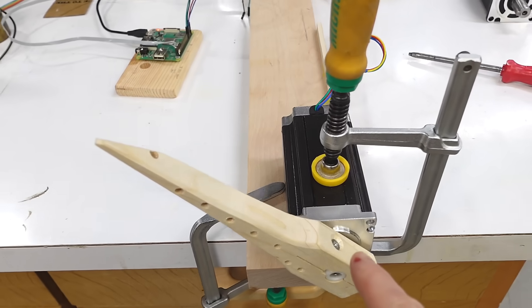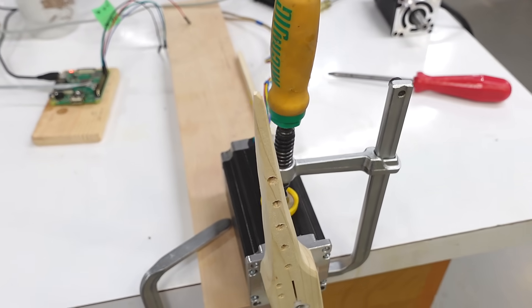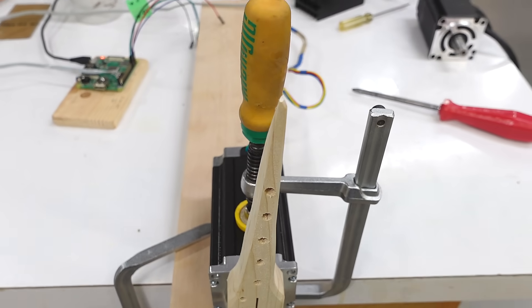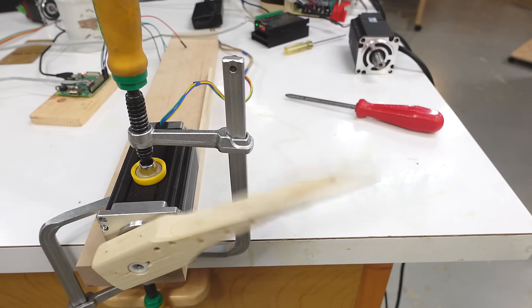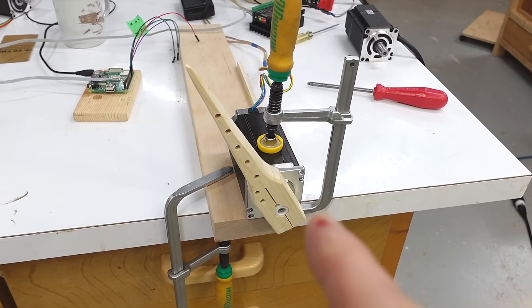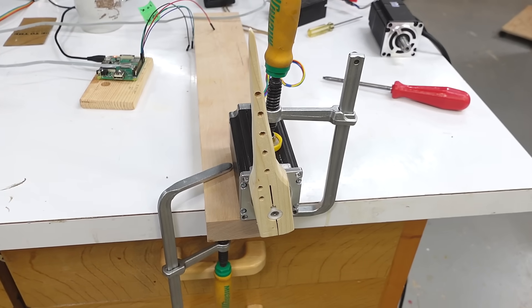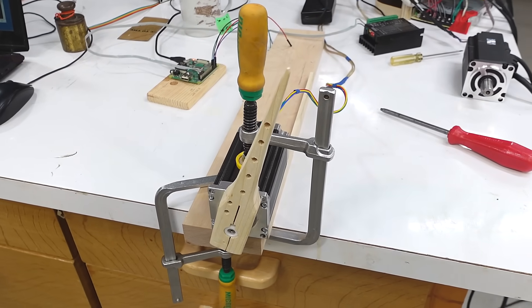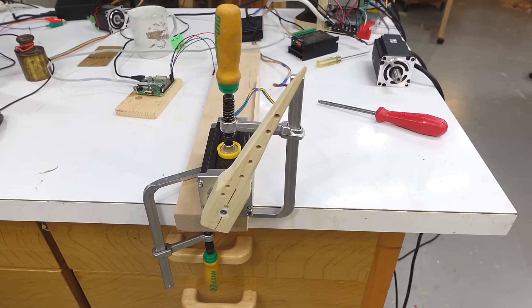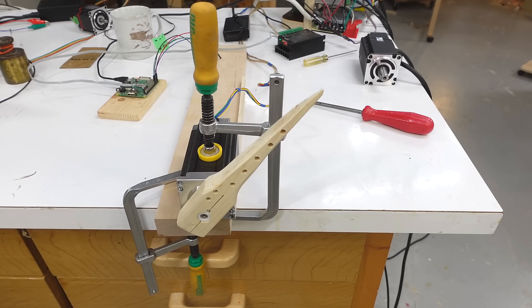With the conventional stepper motor I had to figure out how fast I can give the steps to it. It moves pretty crisp but if I give it the steps too fast it won't move at all. Going the long way around this one's the slowest because I just can't ramp it up just the right way — getting motion curves for high performance on a stepper motor is a challenge. That's taking 200 milliseconds; with properly designed motion curves I could probably get it down to 100.